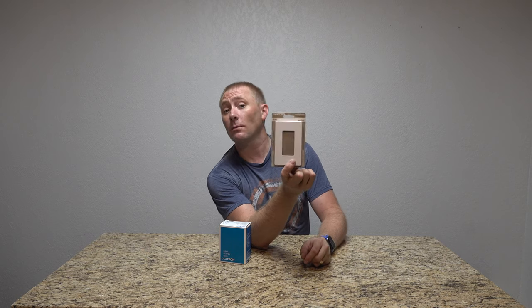They did send me this over, along with a nice fancy wall plate that I won't be using, because I'm actually changing my wall plate from a single to a dual gang. My house is a little bit different. If you watch my channel, I've done a lot of installs in my basement because that's the only one that has a neutral wire at the switch. My basement was done later — the upstairs was built in the 70s, and at almost all my switches I do not have a neutral wire. This does, like most smart switches, require a neutral wire.